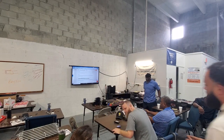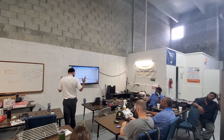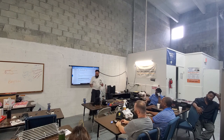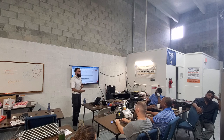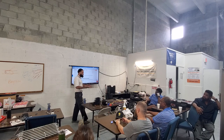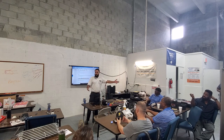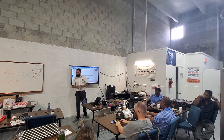Okay, again, we said fresh food compartment 37. We said freezer compartment 0, plus or minus 3. What kind of equipment are we using to get these temperatures? I said it was 55 and 32. What else can we use?